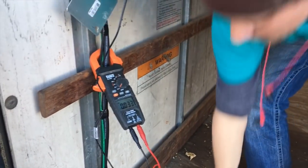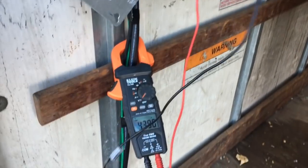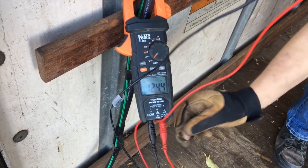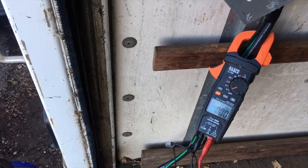I'm going to pop that generator, but I wanted to see what the volt drop would be at 12 amps. At 113 volts, I lost 11 to 12 volts, which is going to increase on the ground as well.